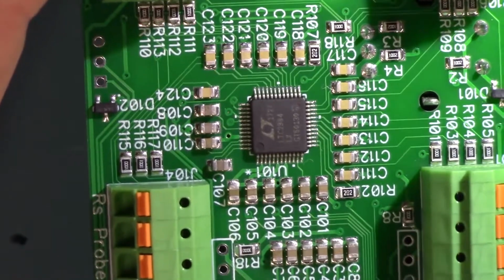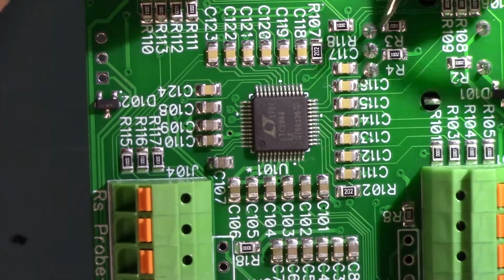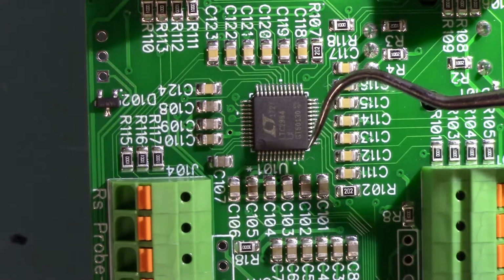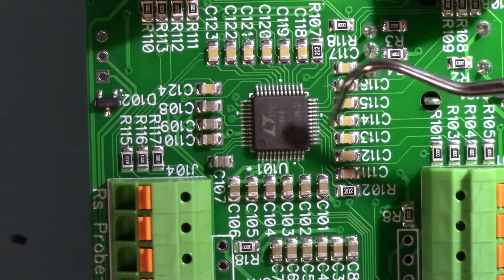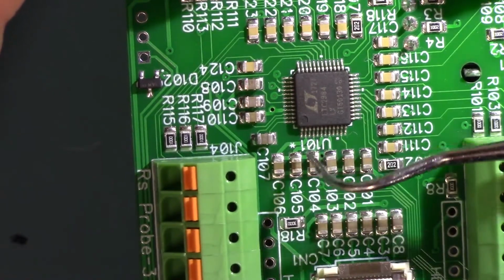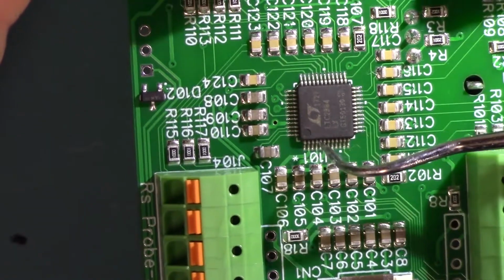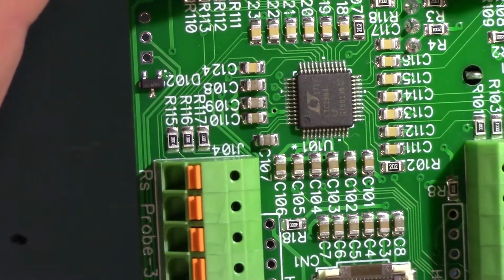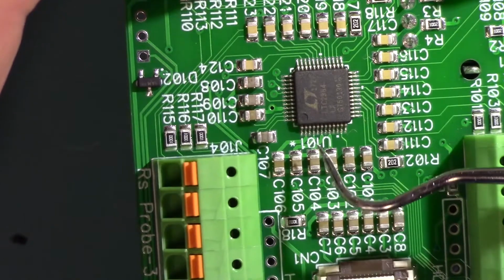The reason why I'm doing this, I have to look through the scope, and I won't be able to tell if it goes out of focus on you until I'm editing the video, and that's really annoying when that happens. And now check the alignment. Here's pin number 1. There's a marker for number 1. The chip's on there straight, and a little more light on there.